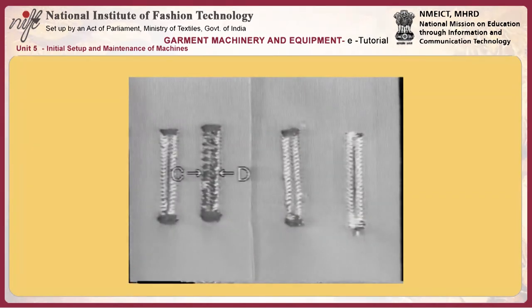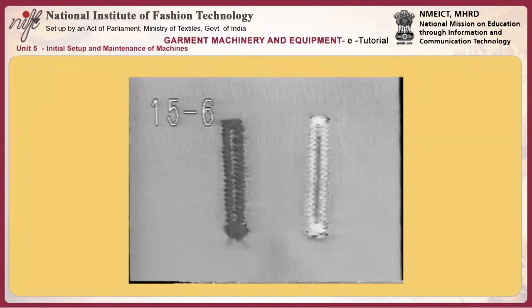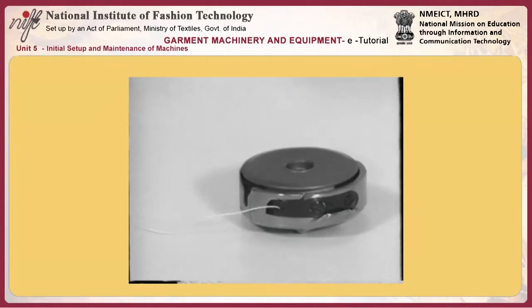Adjusting the arm thread guide A. Thread take-up amount is adjusted using thread guide A. Adjust the thread take-up amount in accordance with the thickness of the sewing product to be sewn. If poorly tense seams are produced, shift thread guide A to the right. If you shift it too far to the right, thread can easily break. If thread breakage arises, shift the thread guide to the left.